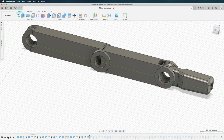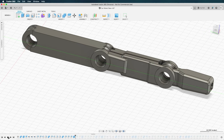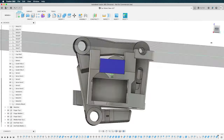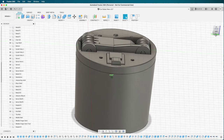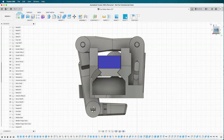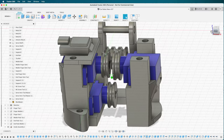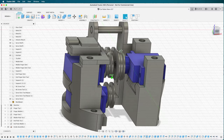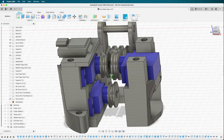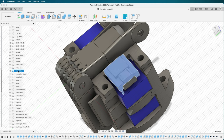I'd love to be able to tell you that I designed this in one sitting, but actually it took over a month of working here and there, and it took several versions to get it to this point. Here's the basic design. Under the cup lid and inside the shell, I have a three-segment finger that is tucked tightly inside the cup. The servos are down below and each one has a servo horn wheel. I'll be using fishing line to transfer the motion from the servos to the finger joints. The whole thing is controlled by a tiny Arduino.